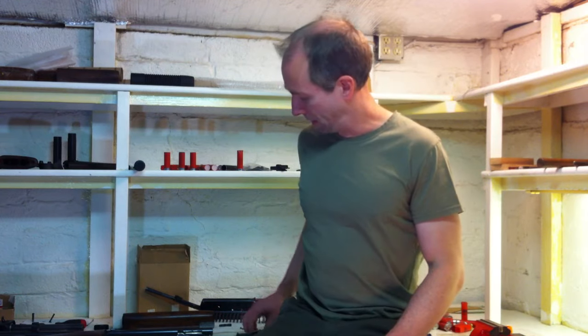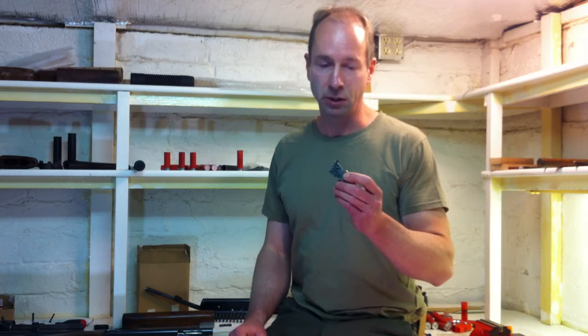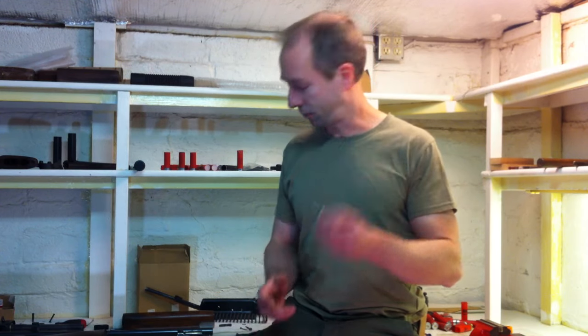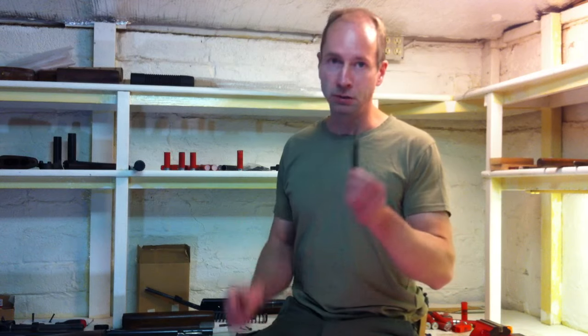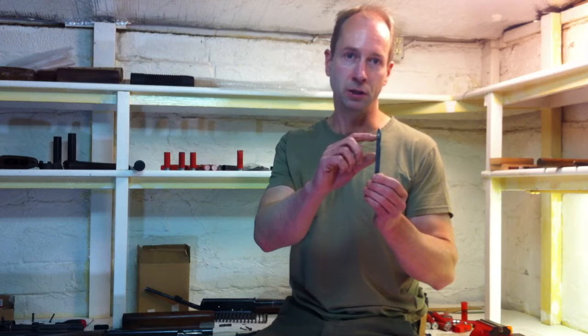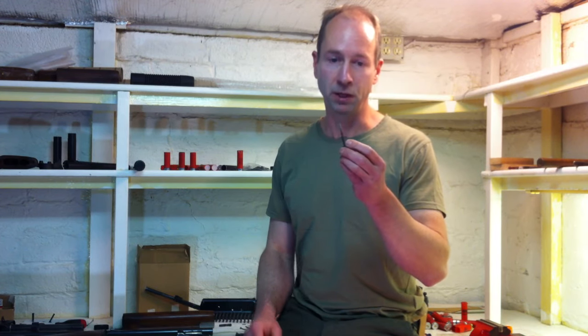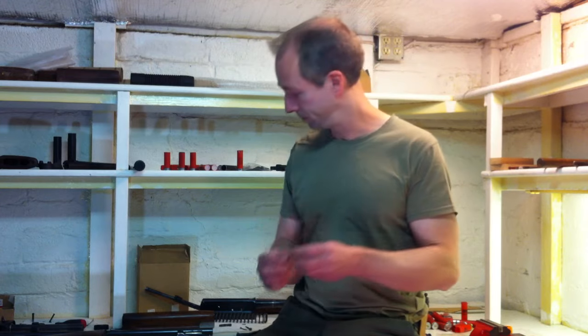The next issue was the old beaten up shotgun I used. I have several of these Remington 11s. I used the oldest one, 10,000 something, low serial number, and I had to replace the locking block because this guide rail was almost sheared off. The link to the locking block was broken here, replaced. Firing pin was broken. The second one had a broken firing pin as well, and it has been re-welded.